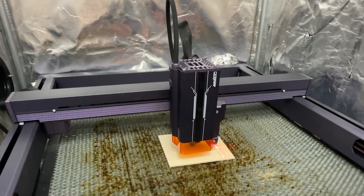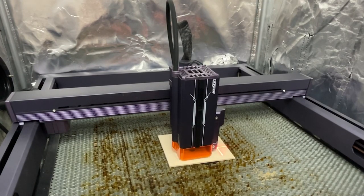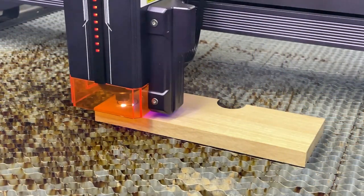It also has intelligent Z-axis control — there's a stepper motor on the Z-axis that raises and lowers the laser module, enabling auto focus. You can also address Z height per layer, so you can start focused at the top and then step it down each pass, as long as you have travel between the module and the material. This helps cut deeper into thicker materials. Safety features include flame detection, tilt detection, and a key lockout so the machine can't be turned on without the key.